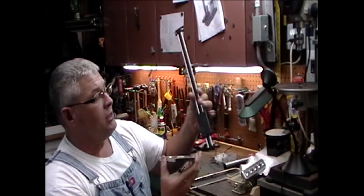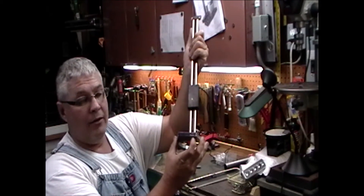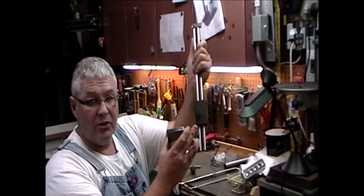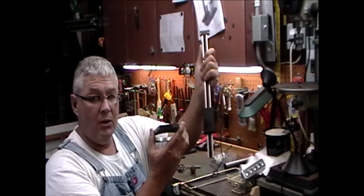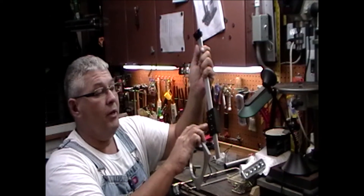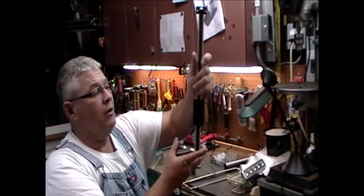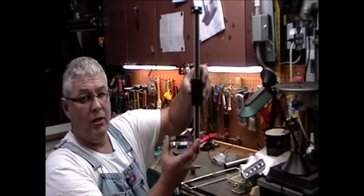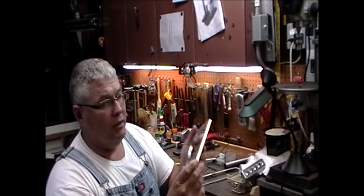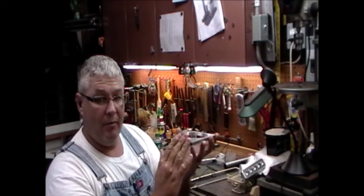The sender — which looks like this and rides up and down a rail — is actually going to mount in a little bracket right here. This portion will be mounted to the mill itself; in the front there are already a couple of pre-drilled holes, and I plan on using those for another piece of aluminum to come out. There's a plastic piece that mounts to that, made for this sender, and it just snaps into place. So basically when the quill goes up and down, the digital sender will remain stationary on the mill itself. I bored the hole — that's completed; it took me forever because I was only taking a little at a time. I reshaped the face just a little to fit the mill head.